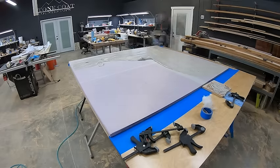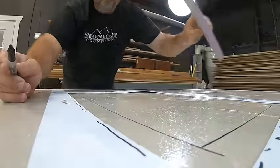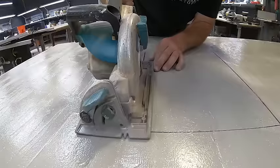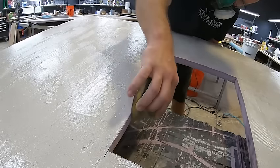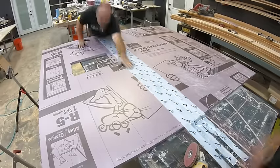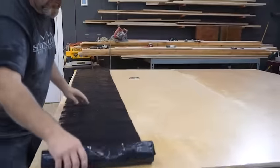I overlap that fiberglass by a few inches and apply it with a shower spreader — it comes out beautifully. I'm going to have some high points, and that's okay — it doesn't need to be perfect at this point. I'm tracing out my window, giving myself about an inch and a half of play because I'll trim it on site after I install this back shower wall. Give yourself plenty of play so you don't worry on installation day. After my quick coat is set up, I'm going to sand off the excess on the back, and just for good measure, I'm applying some Tyvek tape so that as I transport my foam walls, I have no issues in delivery.